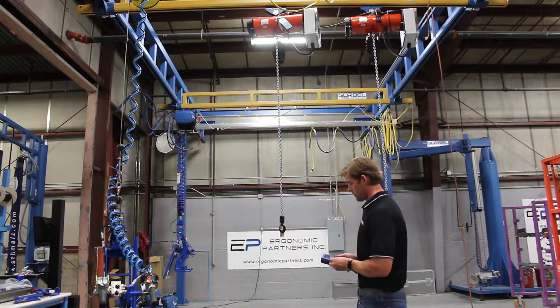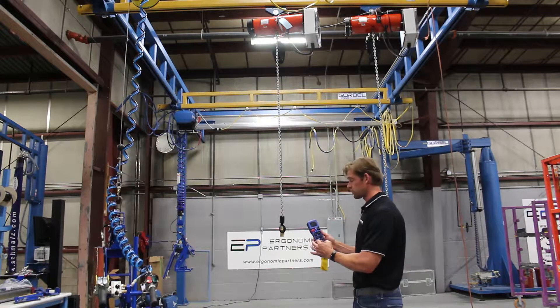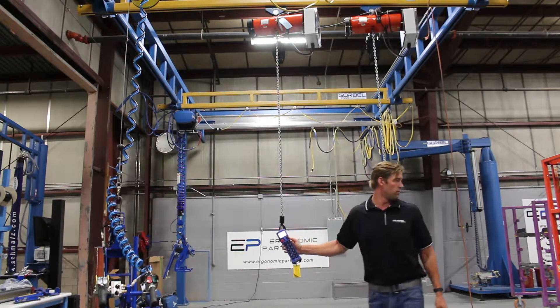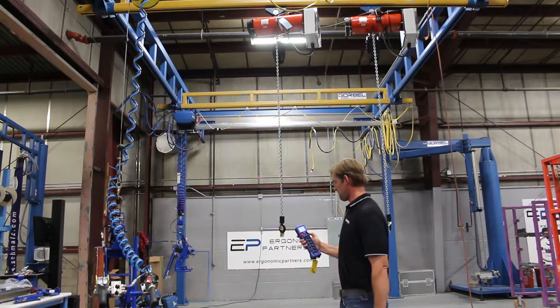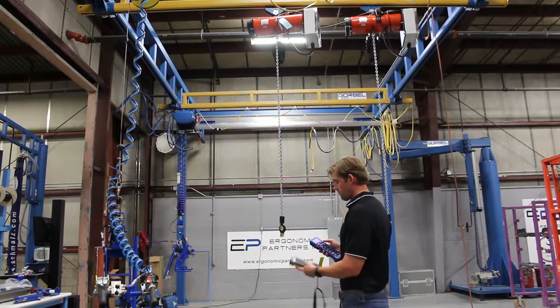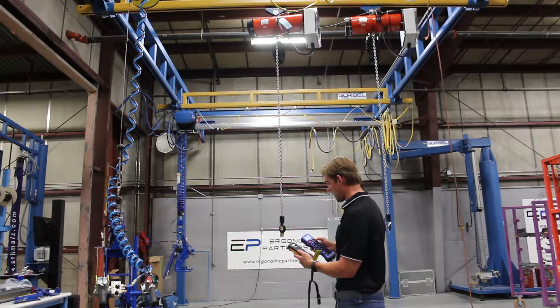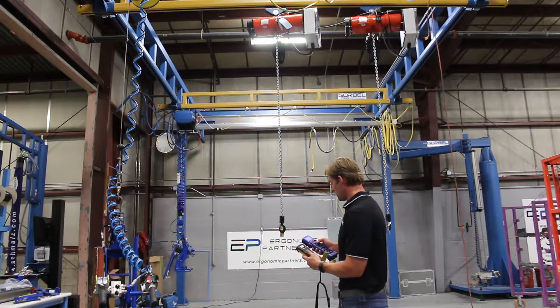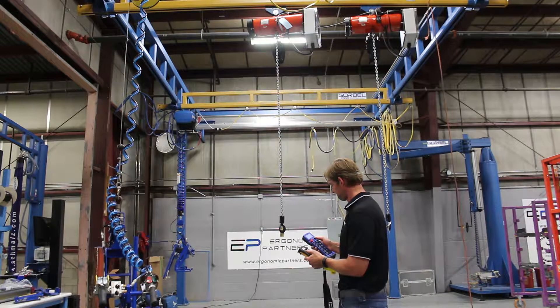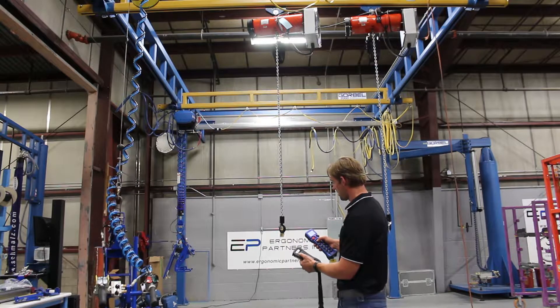I'm going to go ahead and show you how to do that. They have one transmitter here — this is the smart transmitter, your programmable transmitter. By holding the button to the right you enter setup mode. The back of all these transmitters will have an access number and a channel, so I'll scroll through and set the access number to match this transmitter. There's also an RF channel, and that needs to match the transmitter too, so I can scroll up or down to do that.